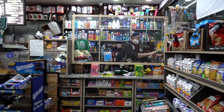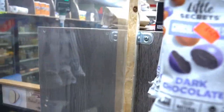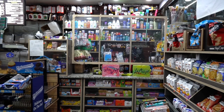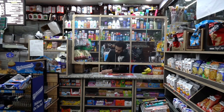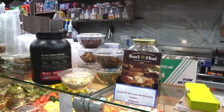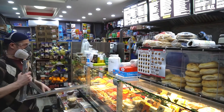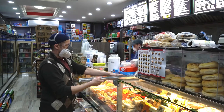I'm going to put this in with just two L brackets. I was planning on doing four but it felt really tight and firm so I called it a day at just two. Always try to find the simplest solution possible. I'm using those boxes of soda as spacers — they are setting the height. Now let's move on to the 59 inch cardboard joint panel getting installed at the deli counter. This is the piece we made together in the shop. I'm just inspecting the counter and making a plan. This is my first time installing on site with these Johnny braces and it looks like we are going to have to use these backwards because the countertop is so narrow.